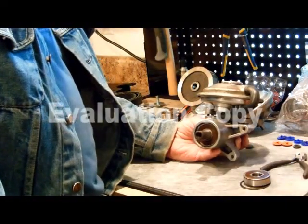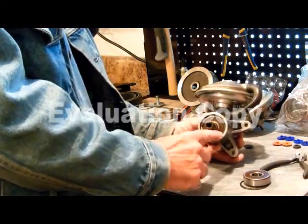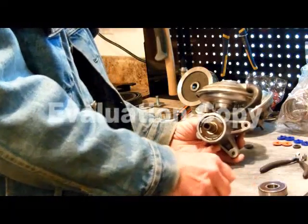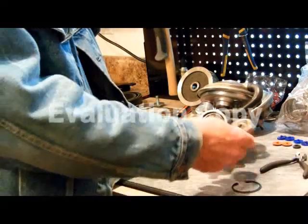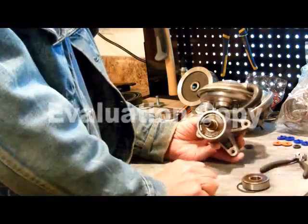With the pulley off, you can see that in the front of the vacuum pump there's a sealed bearing right there, and it's held in by a C-clip — that's what holds it in. These are pretty good bearings and they seem to last a long time, but when we repair the pumps we remove it and put new bearings and clips in them.